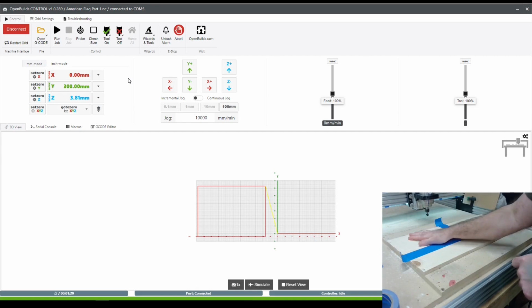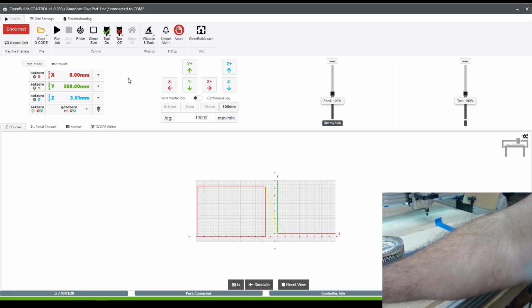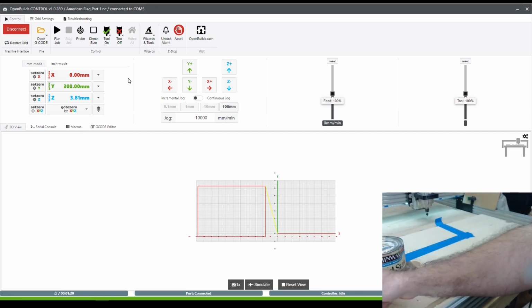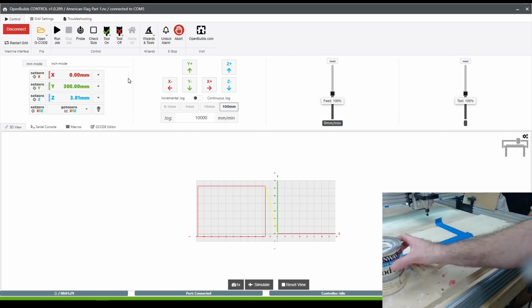Now we're ready for blue in here. Peel up this masking, move it to this side, and do the red. And if you don't like the masking idea, you could also go ahead with the razor blades, a separator, and you just basically stick into the wood here a line of razor blades into that groove you cut, and kind of tap them in with a hammer lightly, and then make a good divider so you don't mix the blue with the red and you don't have to deal with the tape.